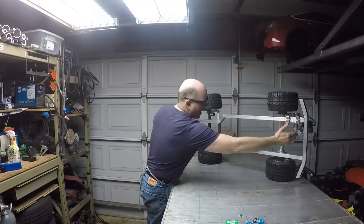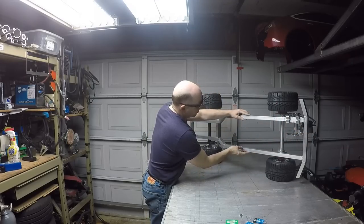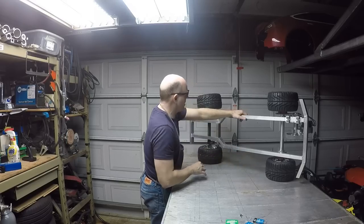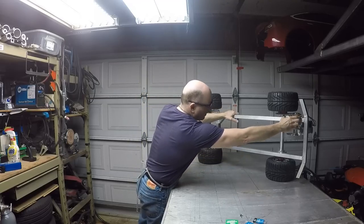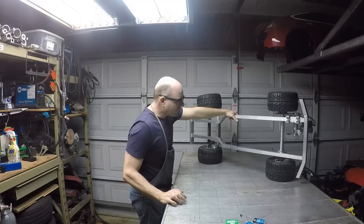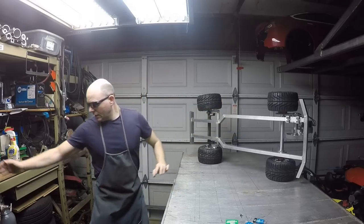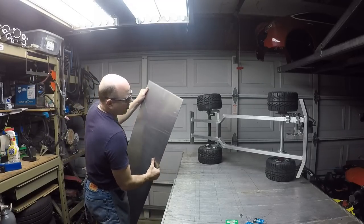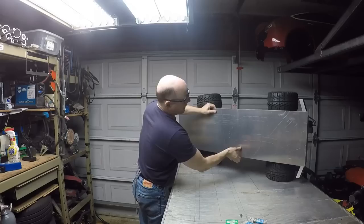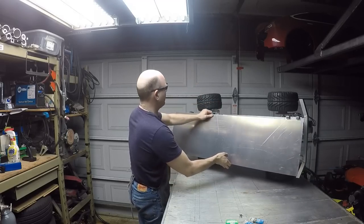It's 43 inches nose to tail. This is about 11 and a half inches, so I wanted to go 14 inches wide here to get overhang for the body to rest on. Then I'll cut the aluminum around the wheels and around the motor mount. I decided to use a piece of 6061 aircraft aluminum, T6 heat treated aluminum, which is what I'm going to fabricate the belly pan out of.